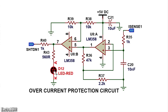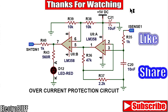Also, an LED will be illuminated, indicating that you have an overcurrent situation or short circuit condition. This will continue until the overload is corrected. The operational amplifiers are contained on the same chip, the LM358 IC. The 5V DC is from the linear regulator, the LM7805, discussed in the previous sections.